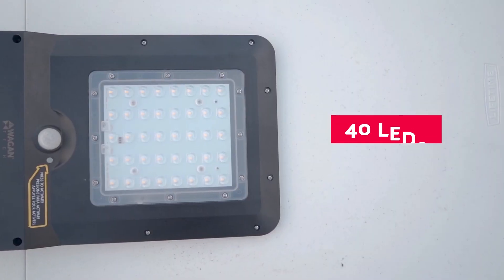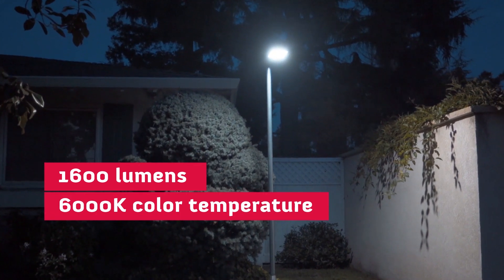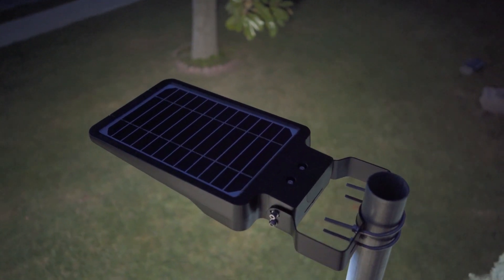On the bottom, we have 40 LEDs mounted beneath a polycarbonate lens that provides 1600 lumens of bright light at 6000K color temperature. These LEDs are optimized for excellent light dispersion, and the reflector provides broad spread of light to illuminate wide areas.